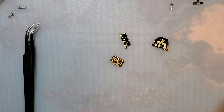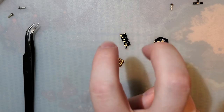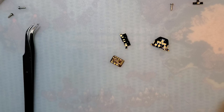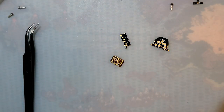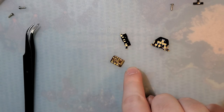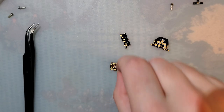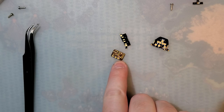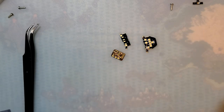Anyway, so I've got the bill of materials listed on my GitHub page that I'll link to. The current version is the big one hanging off of this Game Boy here. But the version I'm testing right now is in that v2.1 folder. The bill of materials is identical. The only difference is this is a smaller board, and instead of having a spot for the button on the board, it just has a pad that you can then solder to a board like this that has its own button.